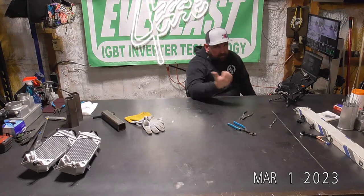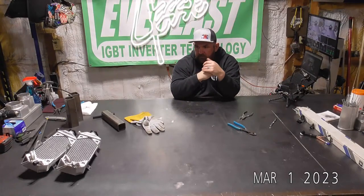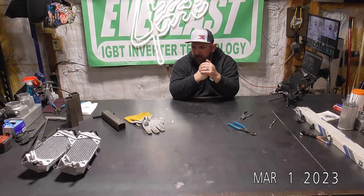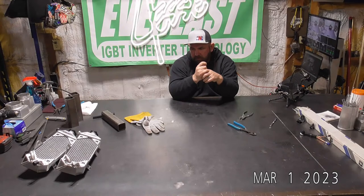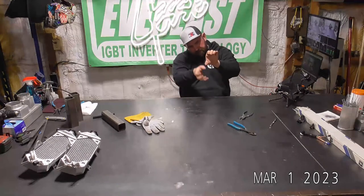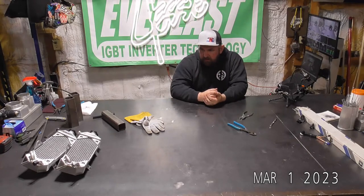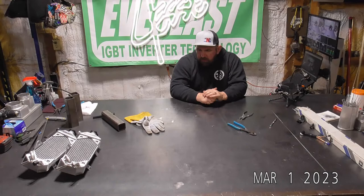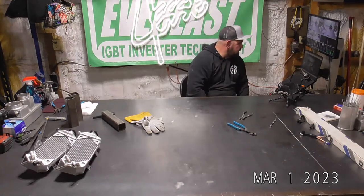That's a tough weld, stuff like that when you get in a real tight spot. Fortunately, I had a lot of practice with that when I was building intercoolers and radiators and intakes. We had a couple of products that had a really tight tube coming right out of a plenum, and it was a 90 down. Welding around the inside of that 90 on those intercoolers was really tough, and it taught me a lot about how to do those. So that's just experience.